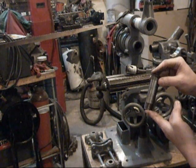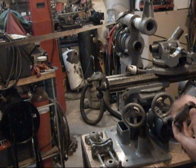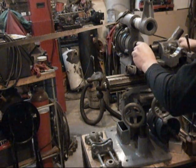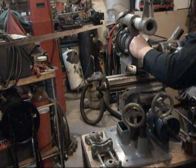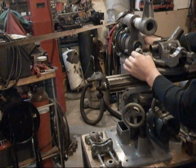I am going to use this milling machine with this 17/32 collet and this hole saw to notch a piece of tubing. I find it very handy for this, and it is about the only useful thing that I can do with the machine right now, due to this being my only collet. And this is my hole saw adapter that I had to make on the lathe.